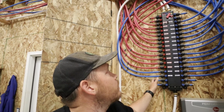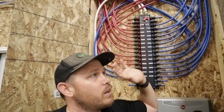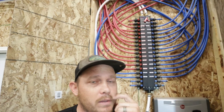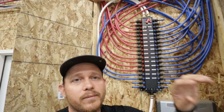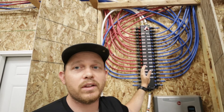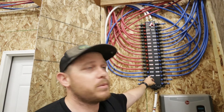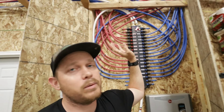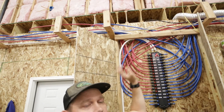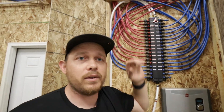I have a lot of line spaces still available, which I actually like — for example, I'm putting a spigot on the outside of my house for an RV hookup, and it's going to have its own dedicated line. Each one of these lines runs directly to the fixture itself. The toilet upstairs runs all the way direct — we built a soffit and ran each line through the soffit in a direct shot all the way to the fixture it's going to.